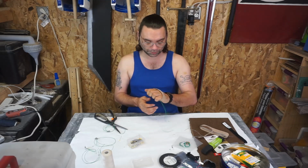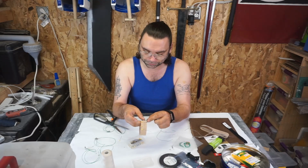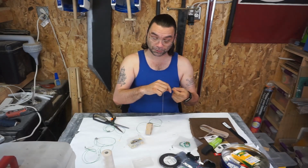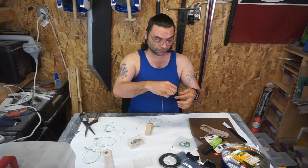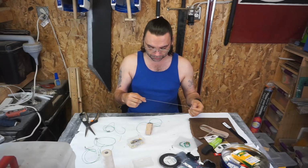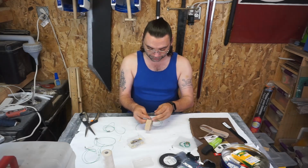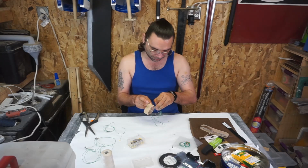Contact feels pretty good. All right, I'm gonna bring you in so you can see how I'm sewing these. Do I want to do strain relief here? Yeah, I do. So I stopped using Cartesian style 3D printers because I don't like the bed moving back and forth, right? Most heat beds don't have any form of strain relief. It moves back and forth. It wears out at that point. That's the weak point in that style of 3D printer.